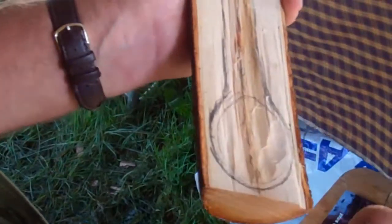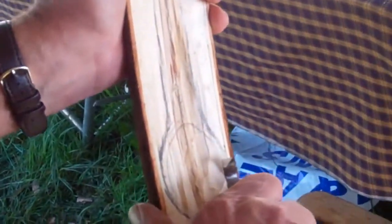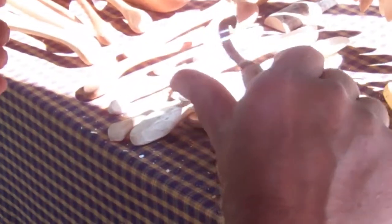So this is my technique, very safe, depending on the thumb in place there. So you're actually squeezing the wood between the thumb and the tool. There's no freehand scraping, slashing. Very restricted movement. It's almost just like clenching a fist repeatedly.